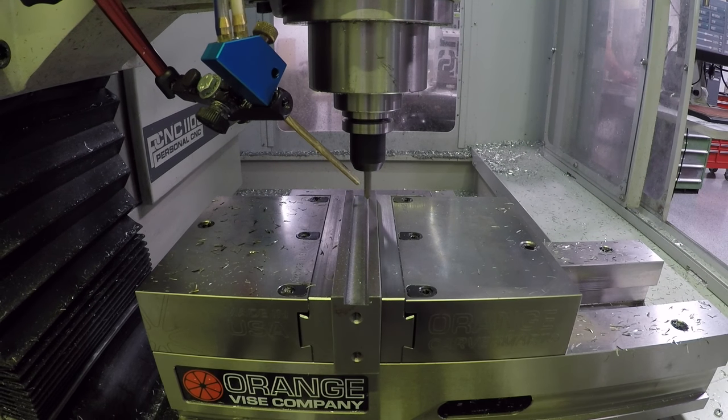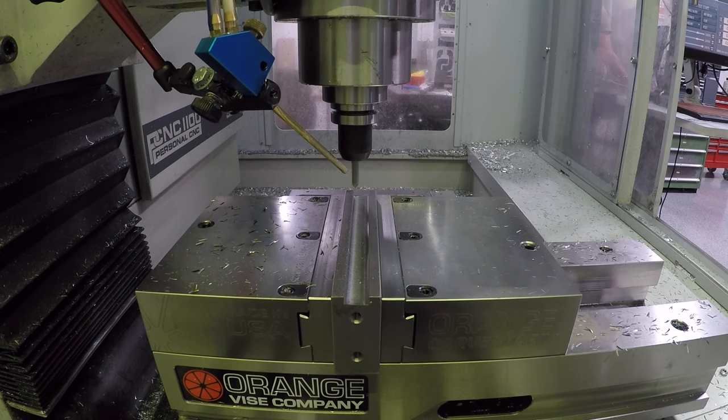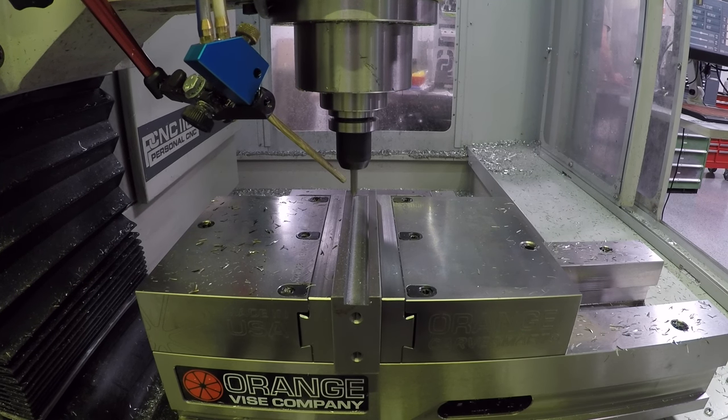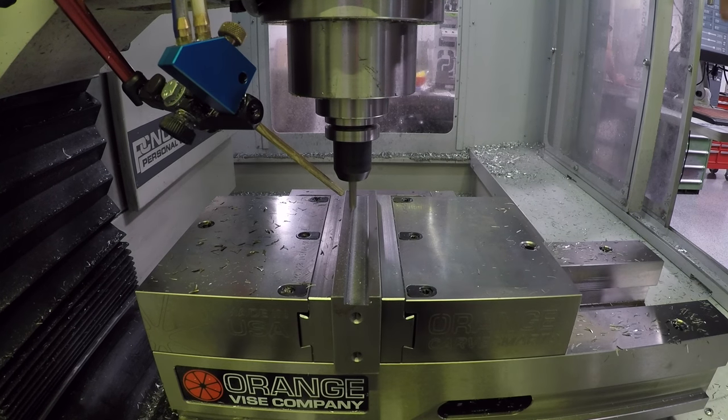It's a little bit a similar thing to smaller diameter inserts on lathes where you're trying to reduce the tool pressure and dig and get enough to activate the chip breaker. I think it's still a little bit different though in terms of the actual cutting action. Damper looks great.